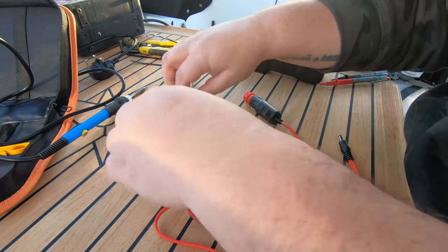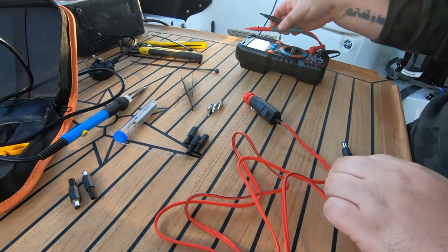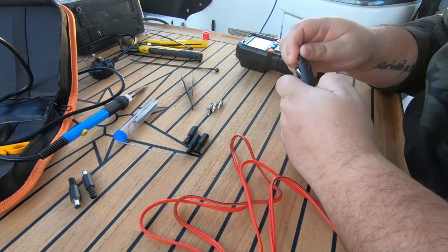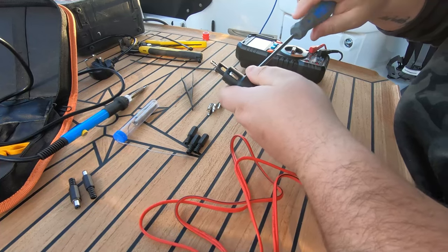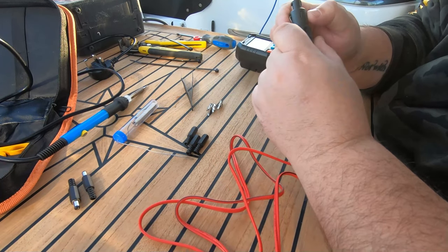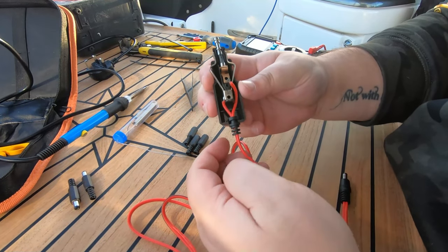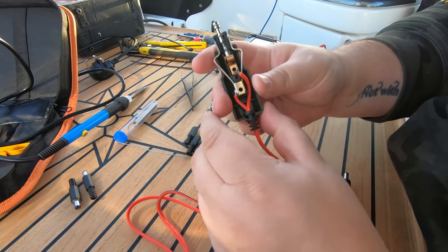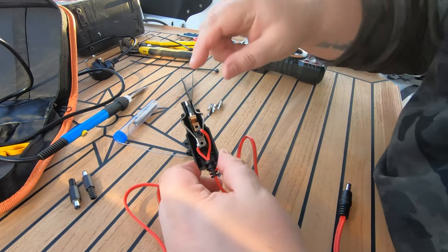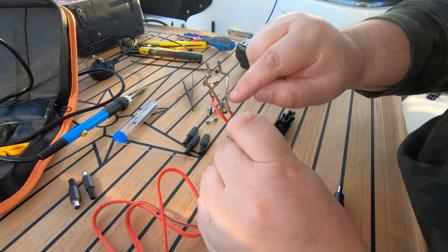Just split apart. And we've got a couple of spares. And we're going to dismantle this, because we don't need this anymore. Hoping that these will just split. There we go. And look, as you can see inside here, you have your pure red, which is your top wire, coming in, going to your center core. In this case, it's fused. But we don't need a fuse for what we're doing. And the outer core is the red and black coming to the outer.